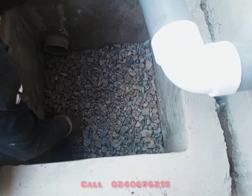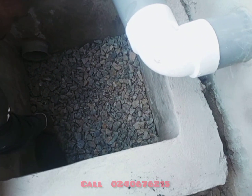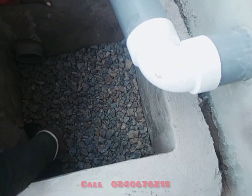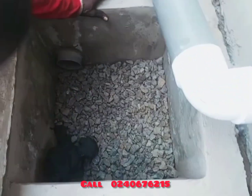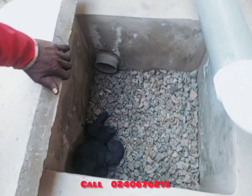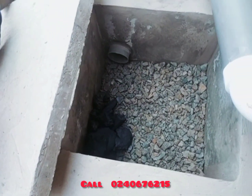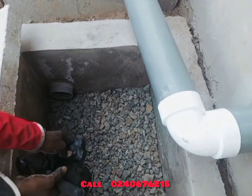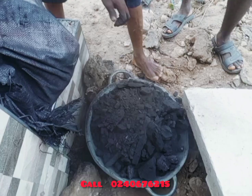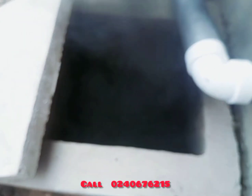As you can see, this is the inlet from the digester into the filter chamber, and where his hand is will be the outlet of the water from the filter into the gutter. After putting in one headpan of chippings, we put charcoal in it. We fill the chamber with charcoal to more than half — it shouldn't be completely full but should be more than half. That is what my professional is doing — pouring the charcoal into the filter. That is the cover for the chamber.